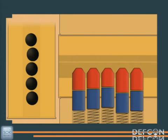So what we try to envision is, you see that the 5 dots on the left side, that's actually up for you. So that if you turn it, not 5 of these blue bits are preventing it from turning, but one of the blue bits is the first to prevent it from turning. If I would be able to take the second pin stack and put it down to the correct level, then another blue bit would be preventing it. So basically, we try to look at a 5-pin lock as 5 locks each containing just one pin stack.